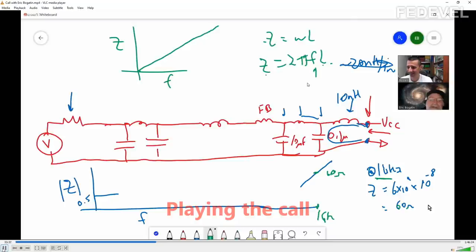And a capacitor, so that's an inductor. Let me do that as an L here. And if we were to do a capacitor, what would the impedance of an ideal capacitor look like at low frequency? What do you think a capacitor is at low frequency? High or low impedance? For low frequencies, a capacitor has high impedance. Yeah, and as we go up in frequency, what do you think it's going to do? It will go lower. Yeah, and so an ideal capacitor is going to drop like this. Ideal capacitor. And so I look at my circuit over here, and I see, okay, I've got an inductor and a capacitor. And I have another inductor after it over here.